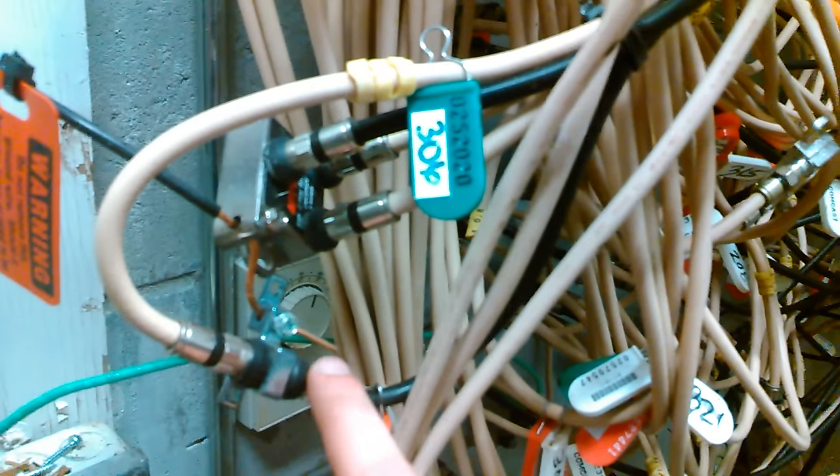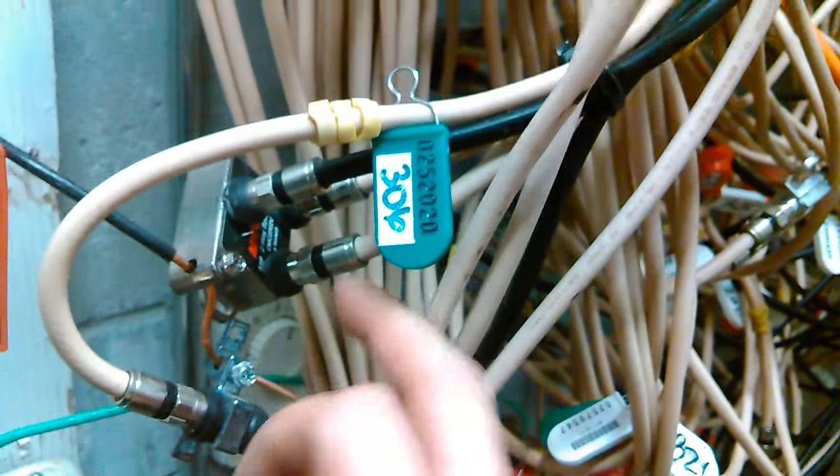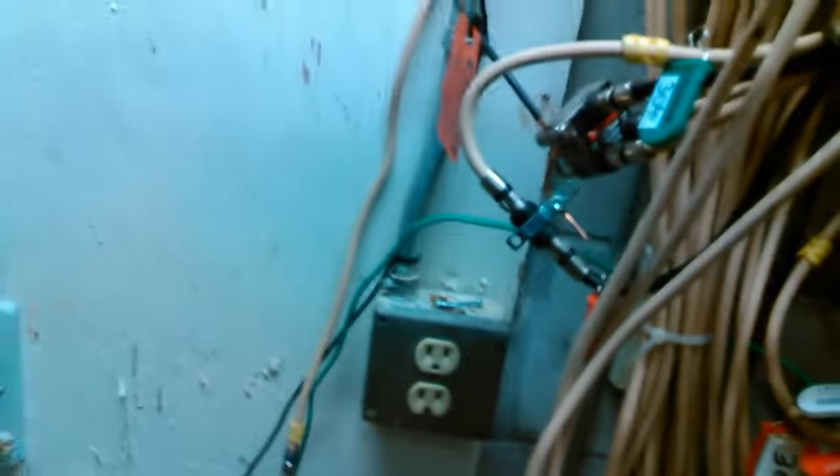These splitters do not stop lightning from coming through. Lightning goes into this wire — it'll go through the shield, it'll ground out, and it'll go down to the ground before it gets to the customer's equipment in most cases. A direct hit is another story.